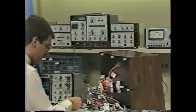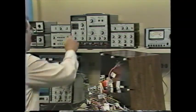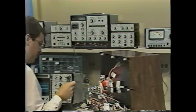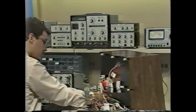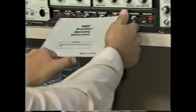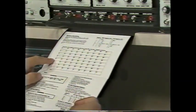Here is an example: a TV which works fine when picking up non-shifted channels, but does not provide a clear picture when tuning a shifted channel. Your customer will have trouble using this set on some cable systems until you fix the automatic fine-tuning circuits. Each channel has its own memory, allowing each to have a different offset frequency. An area of the pull chart is reserved for you to write the values you've programmed.